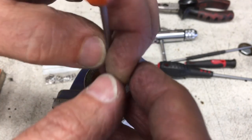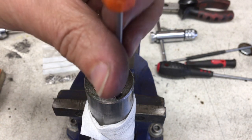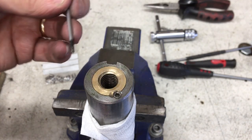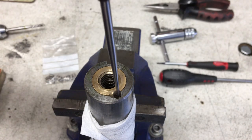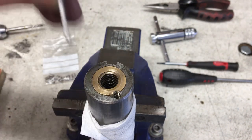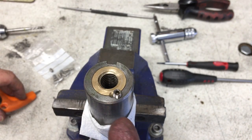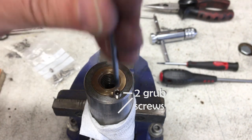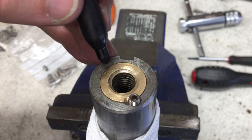We'll get this one in. I'll probably end up Loctiting it, but for now we can just go in as it is. Have they overdrilled it? I'd rather get a single longer one or grind the base off — a bit fiddly to hold. I might order a single long one. Anyway, I'll hold it for now. I just don't want to go through too close to that as a stress raiser.